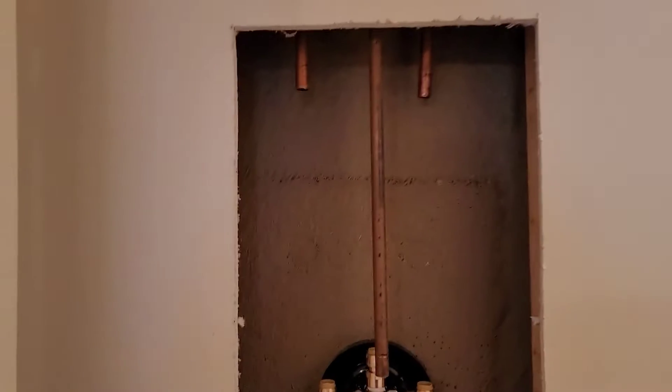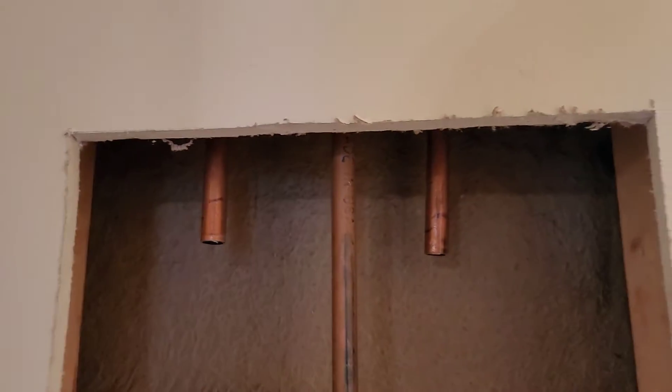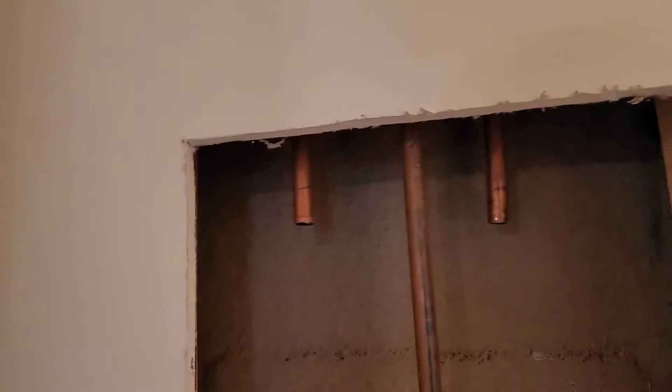That's still not enough — the diameter of this pipe is still too large, larger than half inch because of the swelling from when it froze. I keep repeating that just in case someone jumped into the video after I was explaining it, so bear with me. So what I'm going to do is go up in the attic — the pipes come from the attic — and cut them out completely, pull them up, and replace them with PEX.